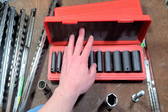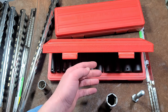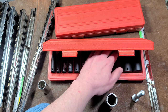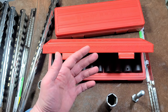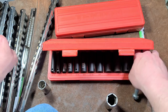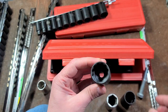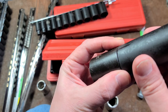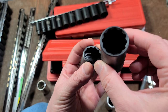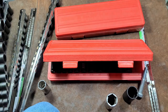There's more than one grade of chrome vanadium — there are a few dozen grades of steel that are chrome vanadium steels, and half the strength of steels is their heat treatment. I've personally had good luck with chrome vanadium impact sockets. Chromoly I believe is a little bit cheaper and also less prone to cracking. I should compare it to the Sunex for wall thickness, because the Sunex are chrome molybdenum — and they're just about the same size; the Sunex is just a hair thicker.